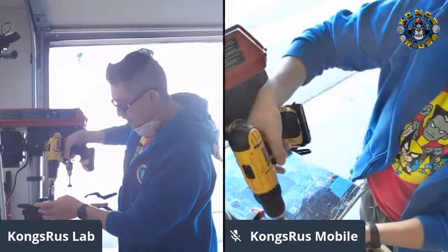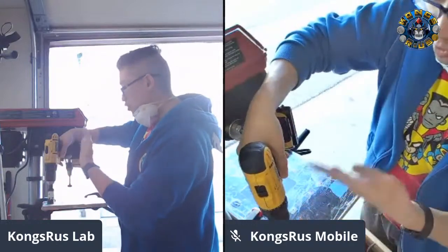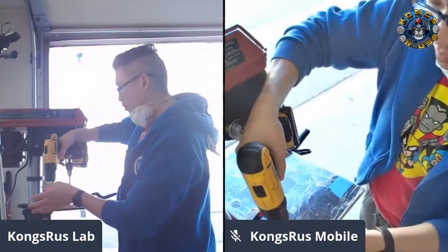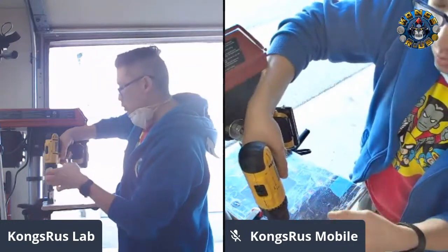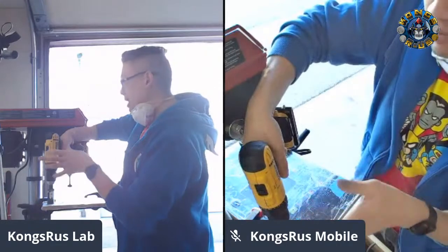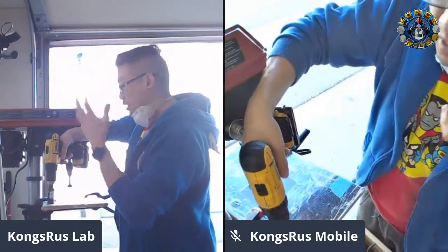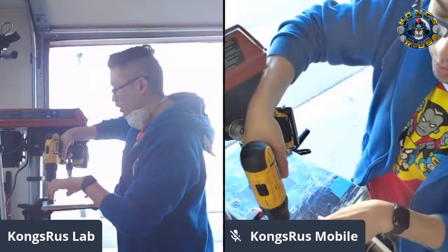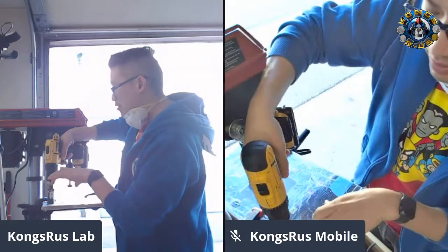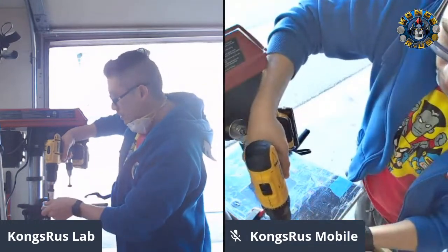So once you get to the plexi section, there's a couple of folks that say you start drilling backwards. You can do either or, whatever makes you feel more comfortable. I'll just do the example where I'm going to go in a backwards motion now, just so the teeth don't catch as easily. I've gotten comfortable enough where I can just drill moving forward, but I know this kind of helps mentally with some folks. If you drill backwards, I'm going to start drilling through the plexi portion only. And once I finish that, you can hear it and feel it once it's done. And then I'm going to pull back out. So let's go ahead and drill backwards.